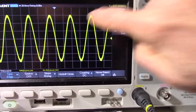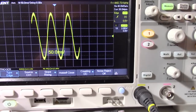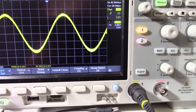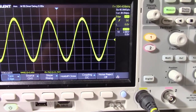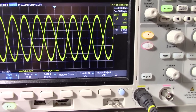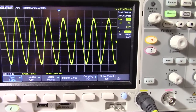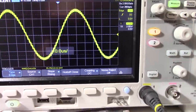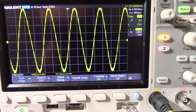We're at 20 hertz and it is completely flat. Let's see where it starts to roll off — wow, that's 10 hertz. I think the other amp was rolling off there. It starts rolling off around 5 or 6 hertz. So yeah, it's pretty flat way down, as you would expect from a decent Class A/B amp to compare. Now going up to look at the high end — at 20 kilohertz there is a very slight rise. Let's see where it starts to ramp off — it peaks up slightly.